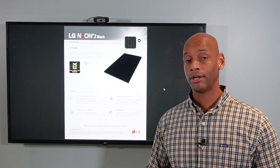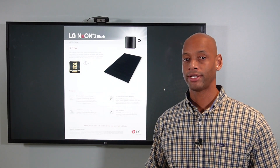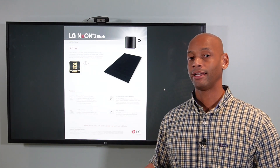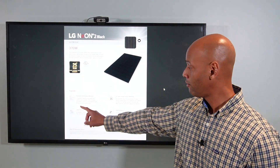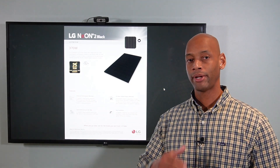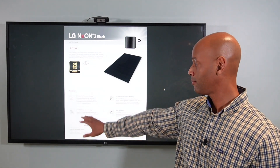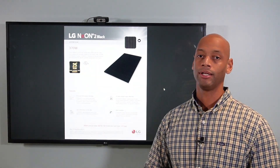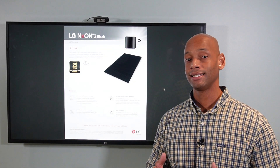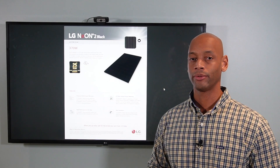The other big difference is the slower degradation rate. Pretty much all tier-one solar panels have a 25-year warranty of some form, but it's only the top-tier panels that guarantee power output over 90 percent at the end of that 25-year term. Just about any solar panel is expected to lose about half a percent of power output per year, but with LG it's close to 0.3 percent per year. Net that out and the panel is guaranteed to provide at least 90.6 percent of its initial rated power at the end of year 25.